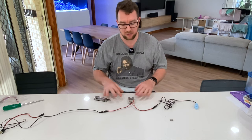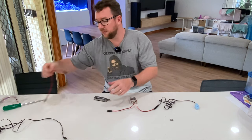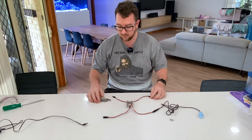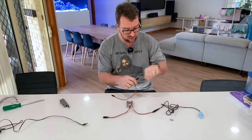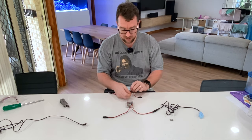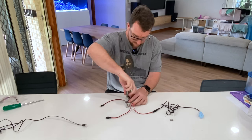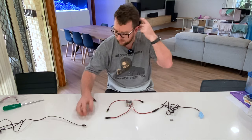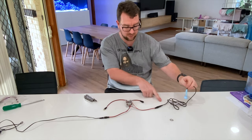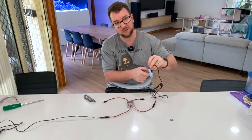So the concept of our relay now works. All we have to do is run the power for the skimmer through these top two contacts. I'm going to disconnect the power for a second and to do that we use another couple of these inlets and outlets. Basically the skimmer power comes in here, plugs into that one, and then this plugs into the controller. This intercepts that power — much like we did on the control side, the positive goes straight through from one connector to the other and the negative switches through the relay contacts. We're all connected up. I'll plug the power back in and now we've got full function: when the float switch is down power is on, float switch is up power is off. Simple as that.